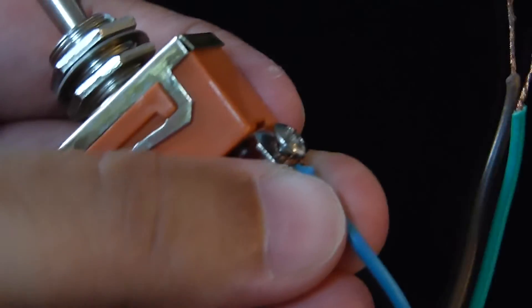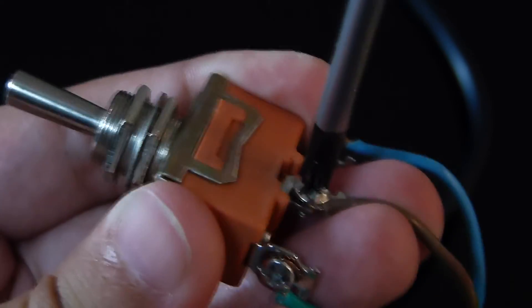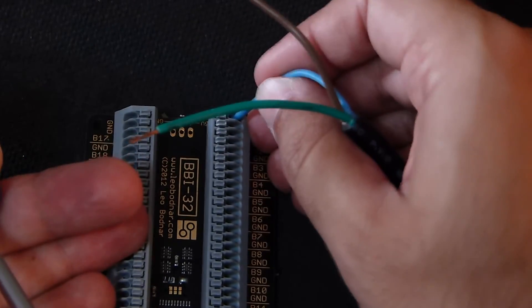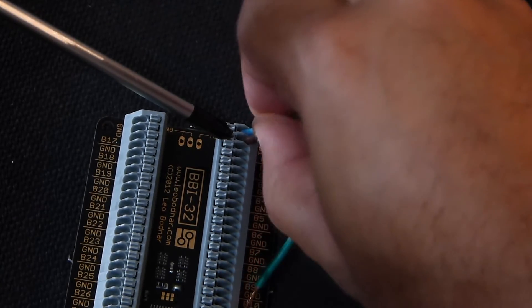Remember that the ground wire is usually the one in the middle — in this case it is represented by the color brown. In the next step we are going to take the other end of the cable and connect them to the board. With the Bodnar boards we have connectors — it will connect one of the top pins to the button connector. Let's take B1 as an example: the cable that leads to the middle pin goes to the ground connector, and the remaining pin will connect to another button.